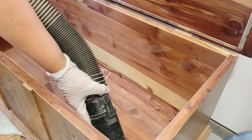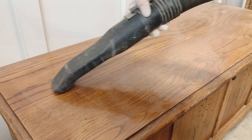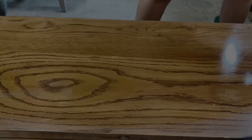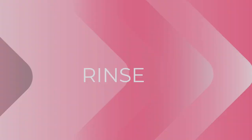There's also some glue residue on top, so I'm going to get to that first. I'm removing the dust and then wiping it down with some towels using Simple Green degreaser. Remember, the reason why we remove all that grease and grime is because if we don't, the abrasive on our sanding paper is going to push all those contaminants back in — they will want to come up after we paint and show as bleed-through. We hate that as refinishers.